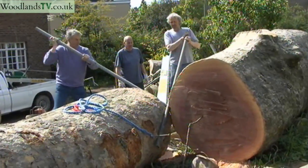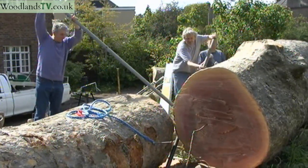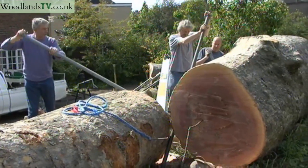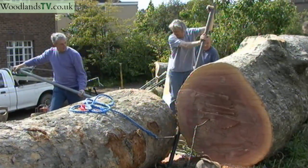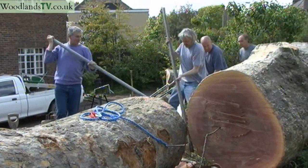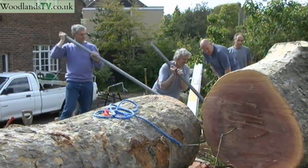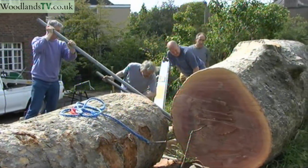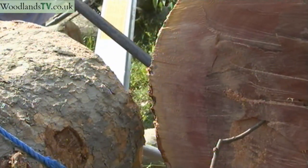The sawmill, the mobile mill, can only do a half length of the entire log. It can make one set of passes on one half and then we move to the other. But you need to set up a frame at the end of each log to carry the rails, and we need more room — quite a substantial gap between the two — so the person operating the sawmill can walk the whole length of both without smacking into the other.